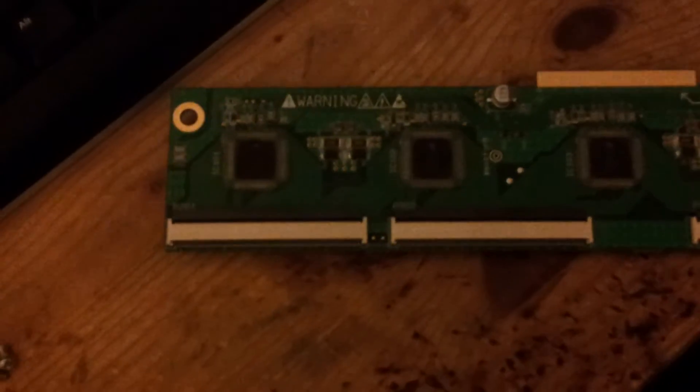So I've got the buffer board over here. What I'm doing with it is I've got my multimeter and I'm just running it along the board, checking for the normal shorts — putting one probe there, meter along here, checking for shorts, then joining the other. No shorts at all — I can't find any.